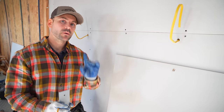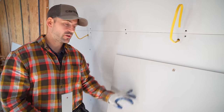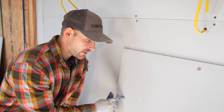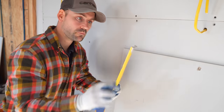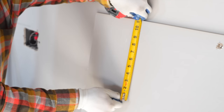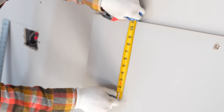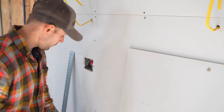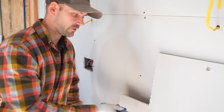Here's an advanced technique for ripping drywall: I've already cut straight down for the window edge. Measure 11 and an eighth inches — the lowest point it needs to go under the window. Hold the tape end with the knife blade, mark 11 and an eighth at the top of the drywall, then use your finger as a guide at that mark and scribe right across the drywall. That gives you a rip cut line. Cut it with the keyhole saw and snap it out.